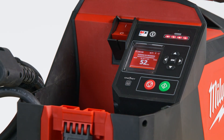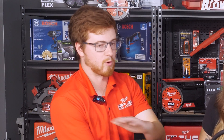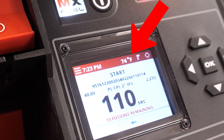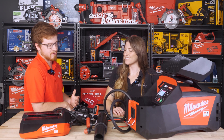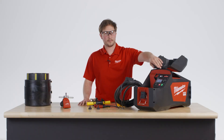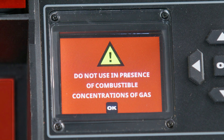Another thing to note: if the battery doesn't have enough charge to complete the fuse, it won't start at all. The tool is very smart and it'll make sure you're not making any incomplete fuses — no questions out in the field. The ambient temperature is going to affect the fuse, so the tool is actually reading the ambient temperature, taking all the data of the coupler and that temperature together to determine how long the fuse needs to go and how long it needs to cool as well.